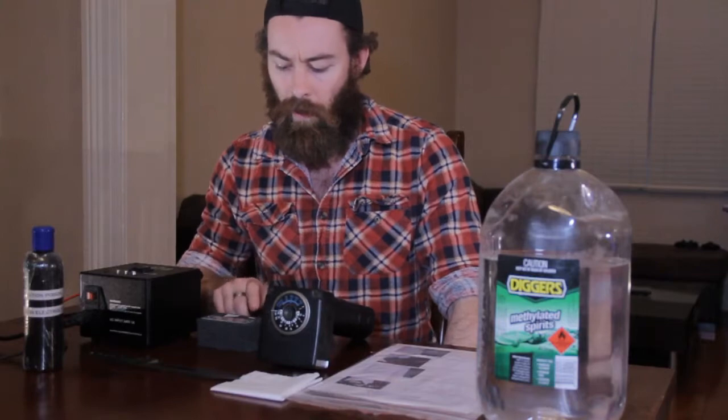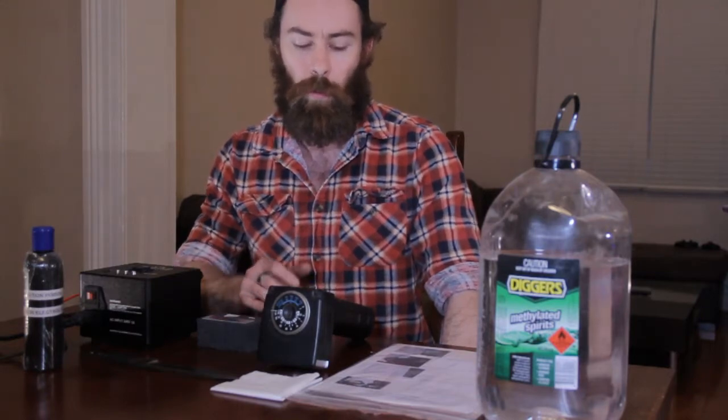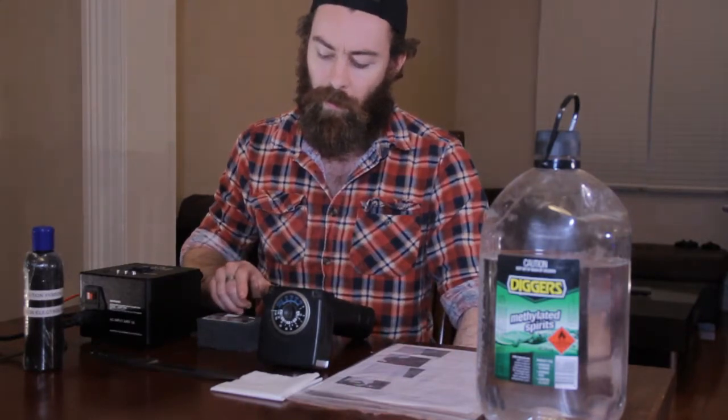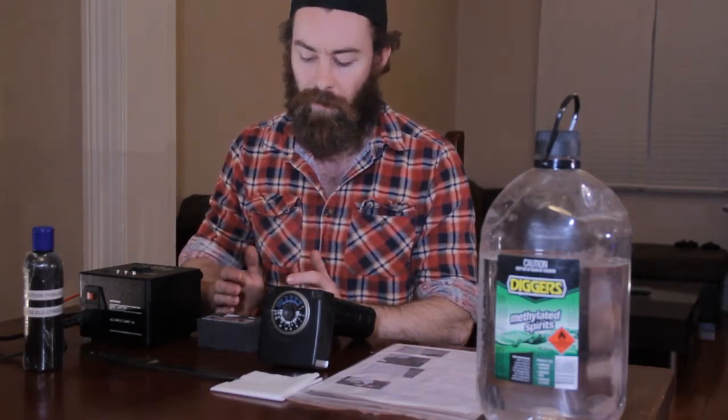You need to print your design onto white paper. The iron in the toner is apparently what does the job for you. When you hit it with the flash, with the flash toner stencil overlaid, the iron particles jump and they perforate the stencil — that's what allows the electrolyte to access the steel. But it blocks the steel everywhere outside your design if you've had a successful imprint of your image into the stencil.